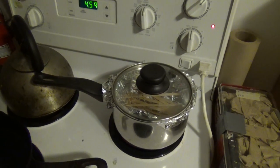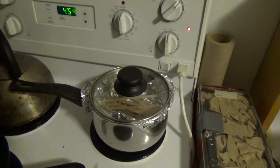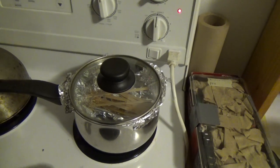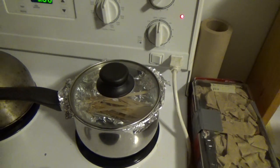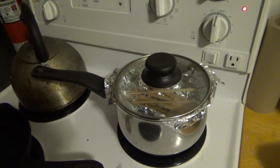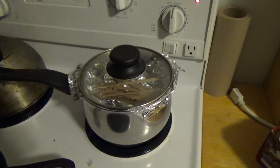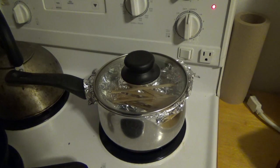I am boiling some water. The rib cage for the vessel is in tin foil, with water underneath. Once it starts boiling it will create steam and soften the wood. This is a very time-consuming method. You boil the water and put some tin foil over it — it's kind of like a steam oven, which is what they used in the olden days to bend planks.